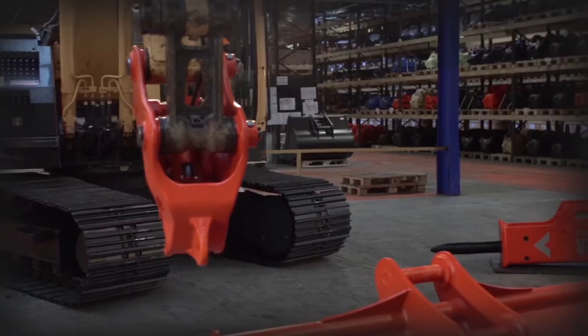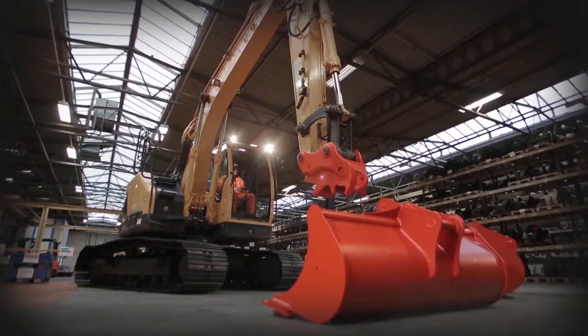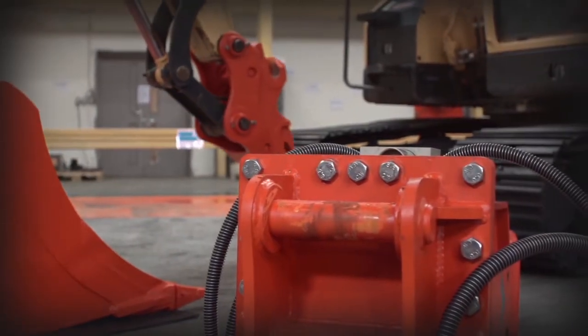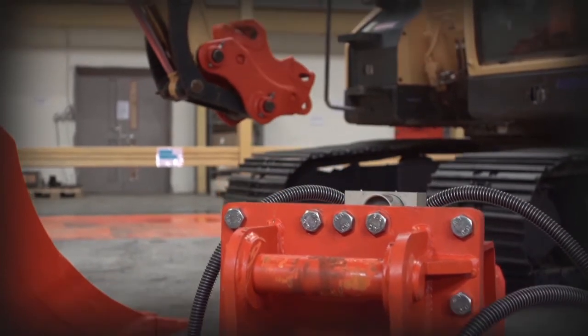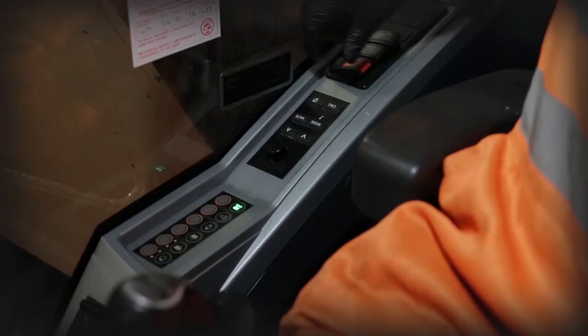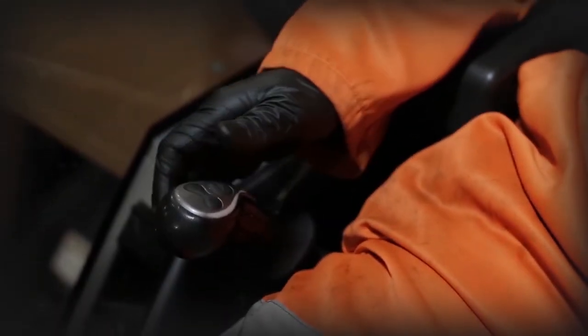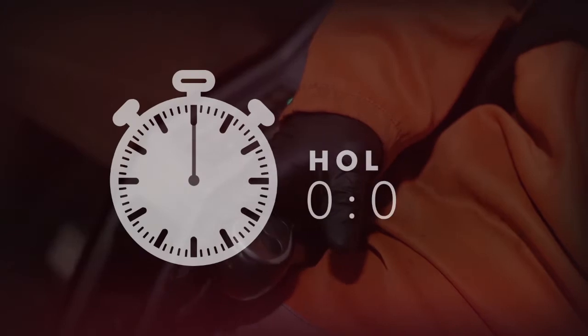First of all, move the dipper arm towards the machine and place the coupler in the fully crowded position to release the mechanical backup system. Move the coupler switch to unlock and hold the crowd lever for 5 to 10 seconds to allow the hydraulic hook to fully retract.